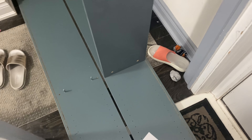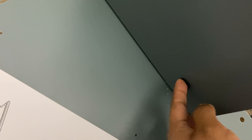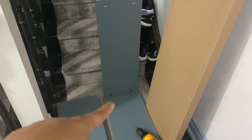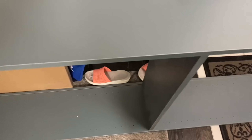Then you're going to put those little screw caps over them. The next step says to put the black screw caps from group one over each of the dowels — make sure you catch it this way. Put it in, then use a butter knife or a flathead screwdriver and turn it so it locks into place. I made a mistake: the screw holes down there, I had them facing this way but they're supposed to face that way. The other one is supposed to have the screw holes facing outside but I did it inside — I can't change it because I already screwed them. It doesn't take away from the aesthetic as long as all the non-natural sides face one way. This step of putting it on and then putting the screw covers on was not so difficult.